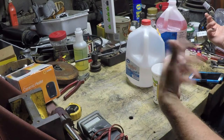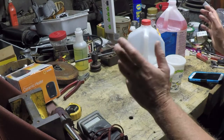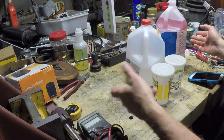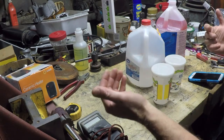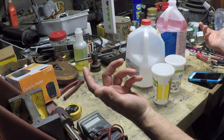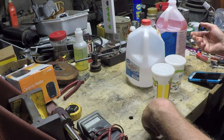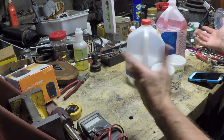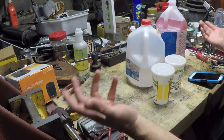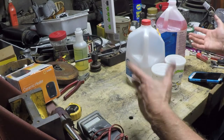In this cooler when I got it, in the reservoir was some sort of water — I don't know if it was just plain tap water or what. Several people have said yeah, they use straight tap water. Some people have even said they recall working in shops where they didn't even have a cooler at all — just a line hooked up to a tap, the water would flow through the torch, cool it, and dump down the drain. That wastes water over time, but it's probably pretty effective because in the United States the tap water temperature tends to stabilize at around 50 degrees Fahrenheit.